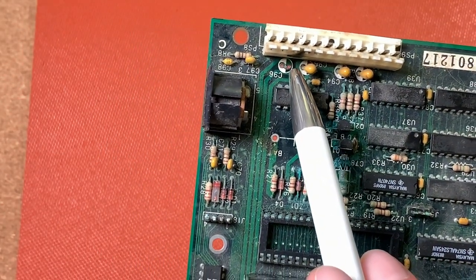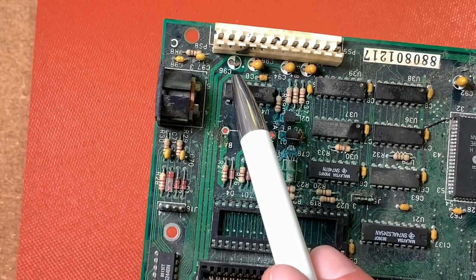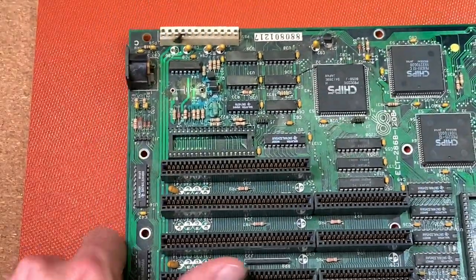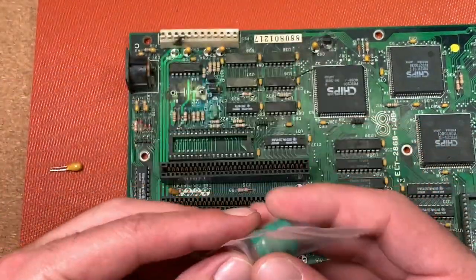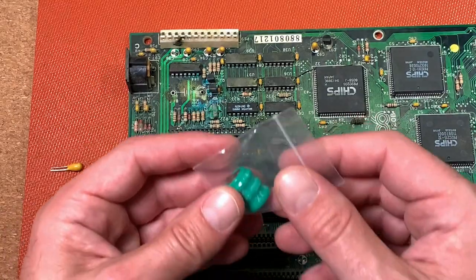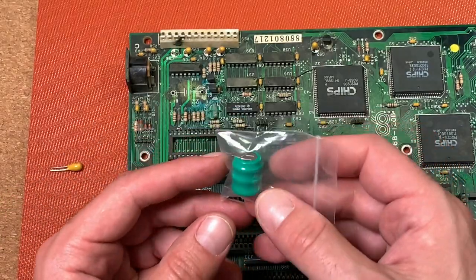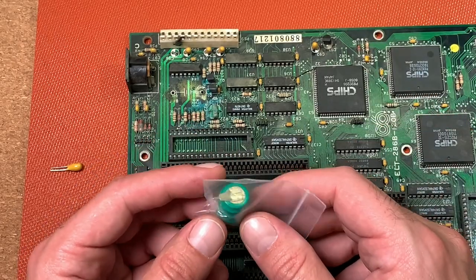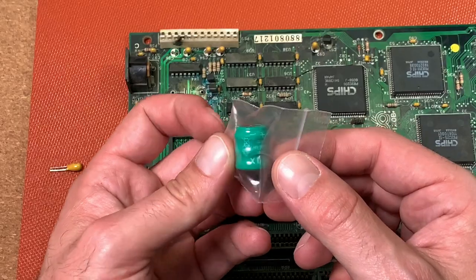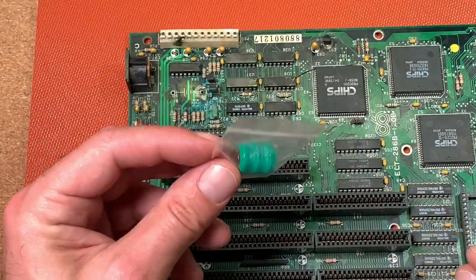First of all, I will put here also a new capacitor — these are 10uF, and I will place a new one here. It's already new old stock. It can also happen that you place an old one and it is also exploding, so just be aware of that. What I'm also not sure yet is if I will place a new battery inside or connect it externally. Basically I like to have it original. But I'm going to put a replacement — a nickel metal hydride 3.6V battery. I bought this on my last trip to Thailand in Bangkok, you can find many shops there where you can get this for cheap. Always be sure where plus and minus is, otherwise it will explode for sure again.